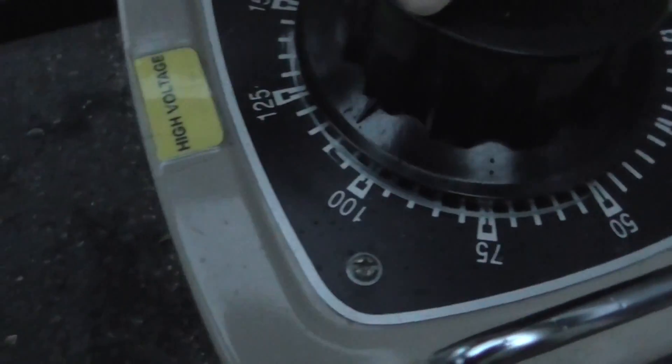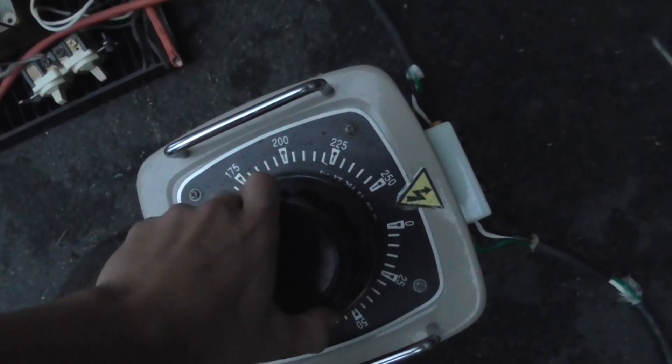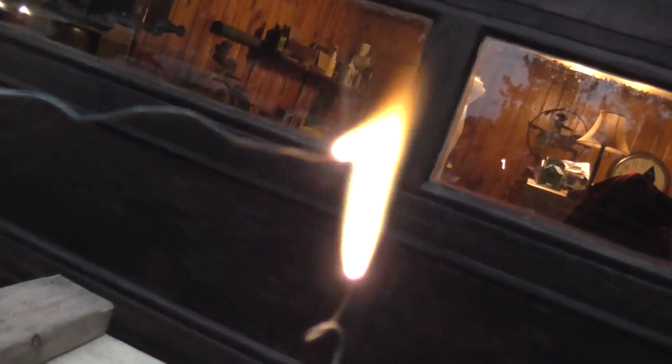Let's plug this thing back in. This time I'm going to do a chicken stick arcing setup, and we're going to try it at 120 volts in at low power. That's approximately 7.2 kV. Now if I bring it up to 240 volts input into the 240-volt windings, there is a bit of corona — a really nice purpley color. Just before the arc starts you'll see a little bit of corona there. That's about 500 watts.